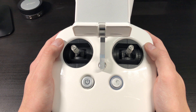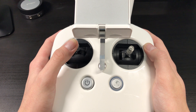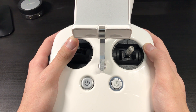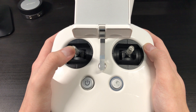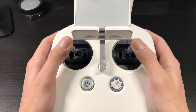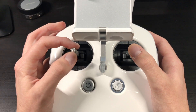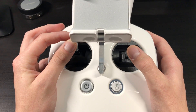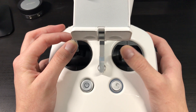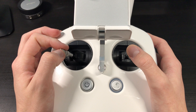Next, you're going to want to keep the aircraft hovering for anywhere between 30 to 60 seconds. From that position on the ground where your motors are primed and spinning, gently ease the stick up so that you're hovering anywhere between 4 and 5 feet in the air. This will allow the battery to further warm up before any strenuous flight. The next tip is to just be gentle on the sticks — don't fly up or forward as fast as you can. Any sudden movements will make the battery discharge a lot quicker.